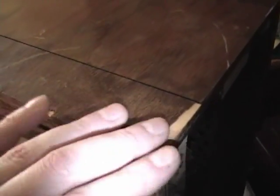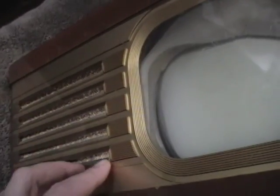Overall, this set's in pretty good shape. It's got a wooden cabinet with mahogany veneer. There are a few chips here and there — this is the largest one — but I think I can strip this down and patch those in. Luckily, all the chips are towards the back side. The plastic faceplate's in quite good condition — a few minor scratches, but those can be buffed out with Novus, and certainly no cracks. The grille cloth looks to be in good shape. Now, as far as this mush around the CRT, that is very, very common — they used an early synthetic foam for the mask that goes around the CRT, and those melt with heat and time. Luckily, somebody found one in good enough condition to make a mold, and you can buy reproduction masks.